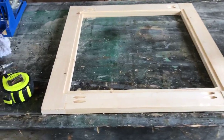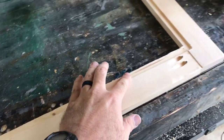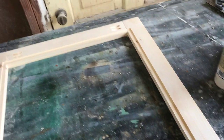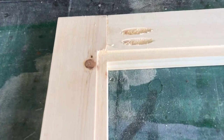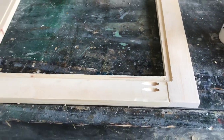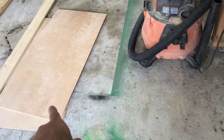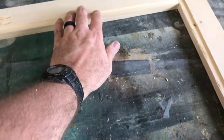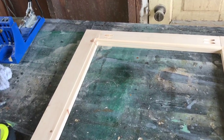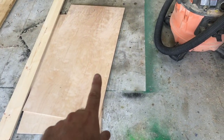After using the CNC you can see it actually worked. I had a little miscalculation and had to use a chisel to knock off a hair in one spot, but it did a pretty good job — that's the easy way to notch out an inlay. I went as deep as the plywood was thick, which I think was about point-20 inches, so my inside pocket is 18 inches by 18 inches. I'm gonna cut that plywood piece to 18 by 18 and drop it in.